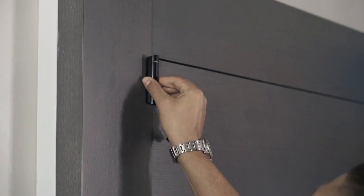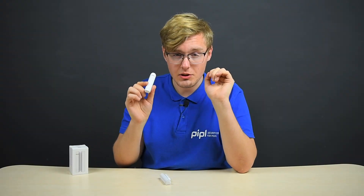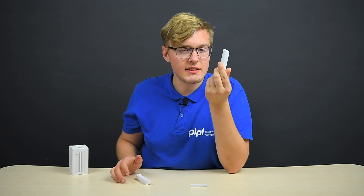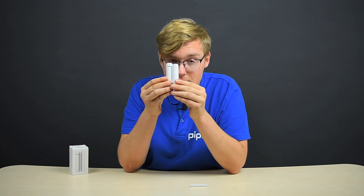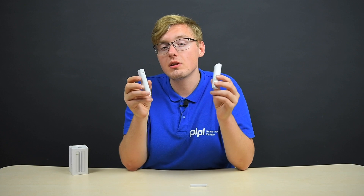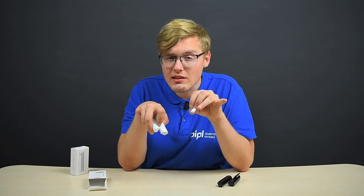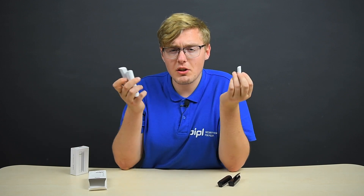What's not mentioned in its name — Door Protect — it's also a window opening detector, used for both doors and windows equally. In the box we have additional magnetic contacts, besides the main sensor, that perfectly fit for on-window install. Even though it's made in the same form as the main sensor, it's just a magnet — intended for on-door install. The working principle is based on a reed switch, which is able to detect when the contacts are closed or open due to the magnetic field principle. What distinguishes the Plus version from a regular? It has an accelerometer built in, and it's able to feel a tilt applied to it and also detect an impact applied to an adjoining door or window. This is all the functional distinctions they have.